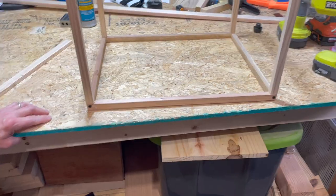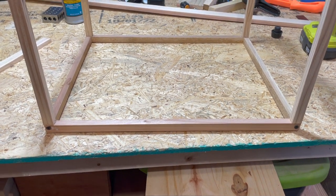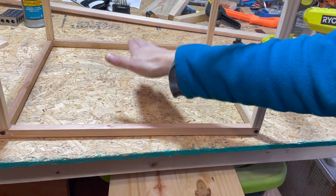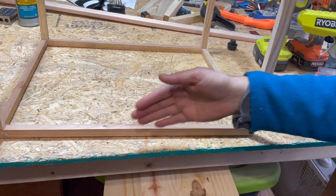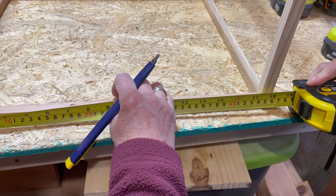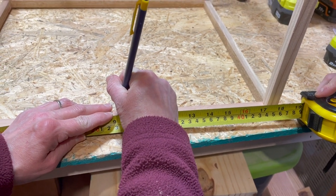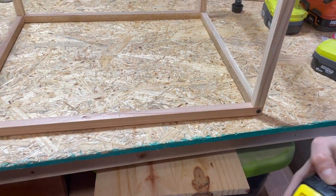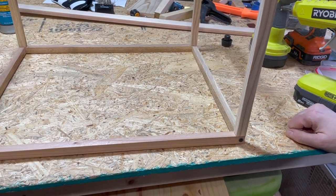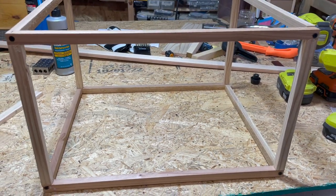Now we have to add one more structural element: a piece that fits on either side, raising a cross member that will sit on the actual lamp itself. We mark the center point carefully — there are some specific sizes and spaces we'll be using. In our specific case we have an 18-inch width, 14-inch depth, and 10-inch height. Those dimensions will change based on your lamp shade, so you can custom-make it to your own size. For this lamp, that's what looks good.